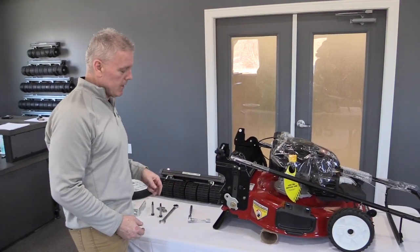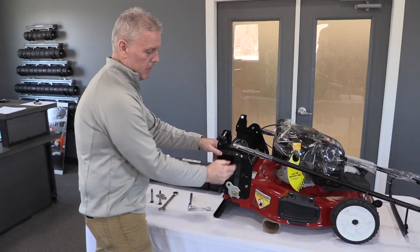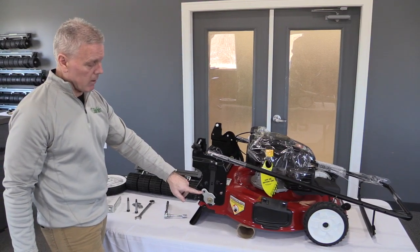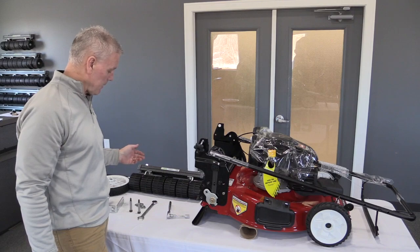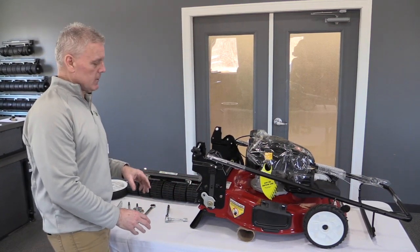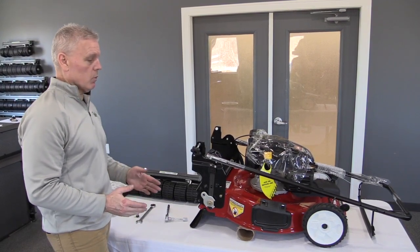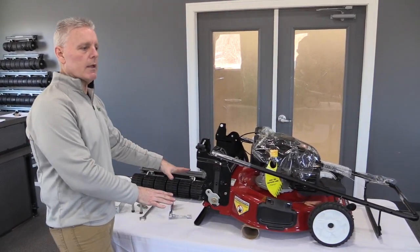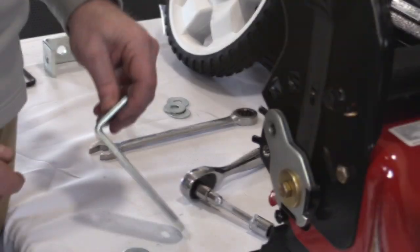Starting on the right side with the tire off, you can see the wheel height adjustment bracket — move it back and forth and it adjusts the wheel height. This is exactly where we pulled Toro's axle bolt out; it has 3/8 threads and our shoulder bolt also has 3/8 threads, so this is a no-drill application. I'm going to do an extra step and put the arm together first without the wheel on so you can see the importance of where we place our washers and how they have to sit up on the shoulder of the shoulder bolt so we don't pinch the arm. The concept is to keep those arms freely floating so the full weight of the roller is on the turf at all times — going uphill, downhill, the roller freely pivots.